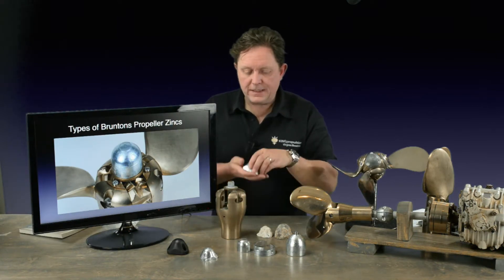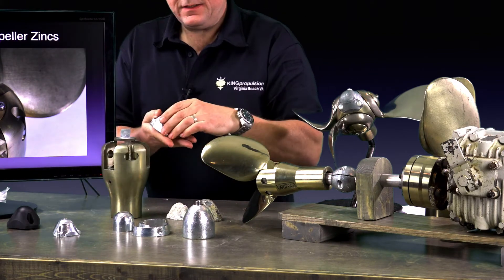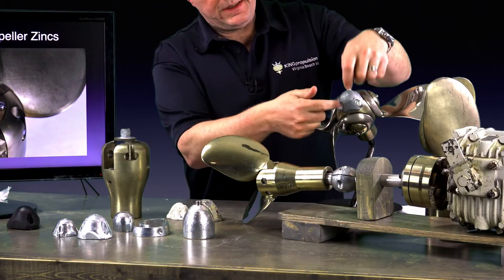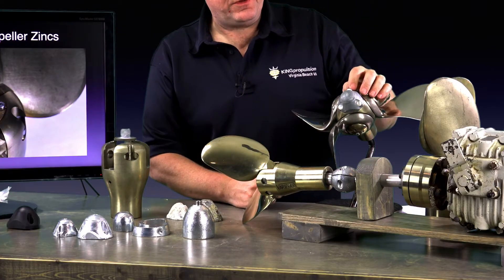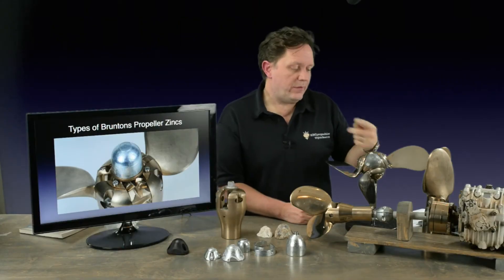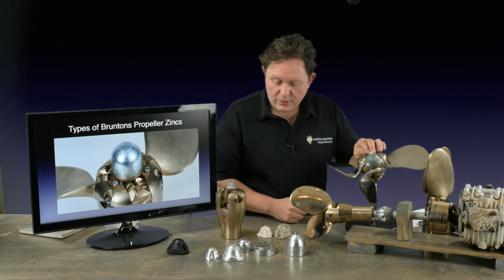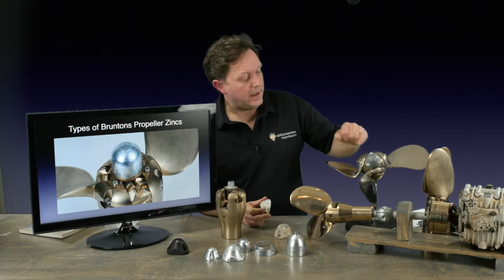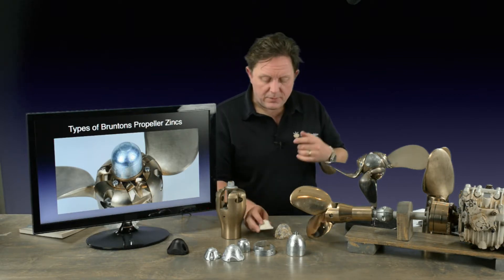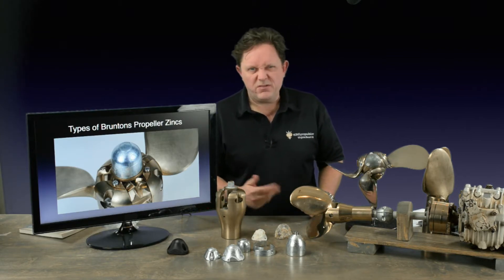For the Autoprop, the zincs are virtually identical apart from different sizes — H5 and H6 — and they fit on with little plastic screws. They just go on as you would a normal screw; they're just lightweight and don't need a lot of force. The purpose of putting these on was to stop the little tabs from wasting away. You can put a little bit of nail varnish on the tabs to stop it wasting, but with the plastic screws it shouldn't normally be a problem for the lifetime of the zinc.